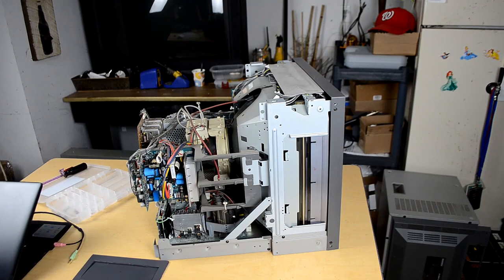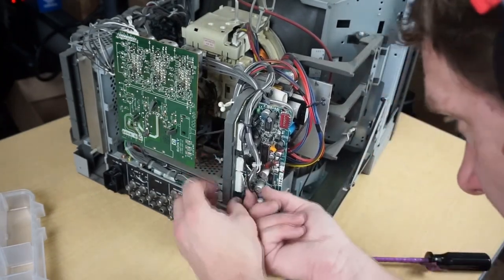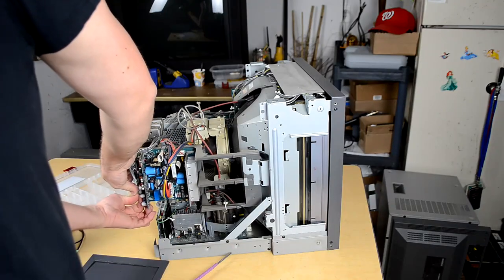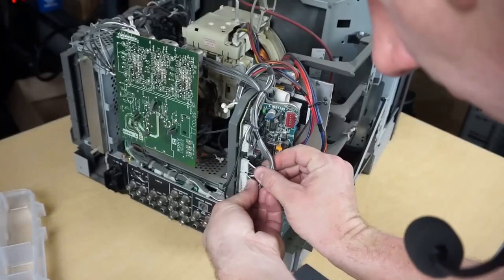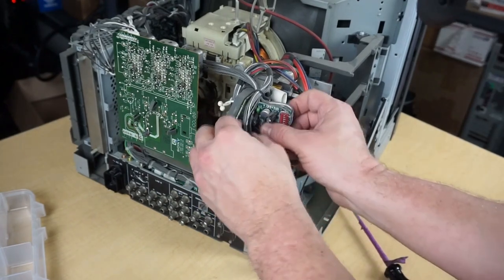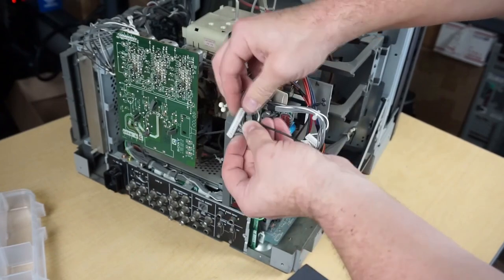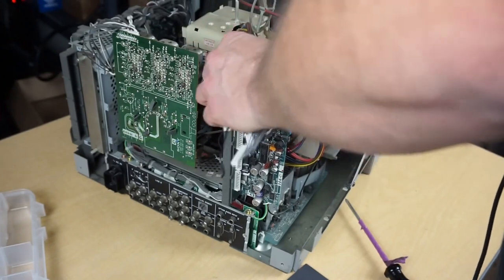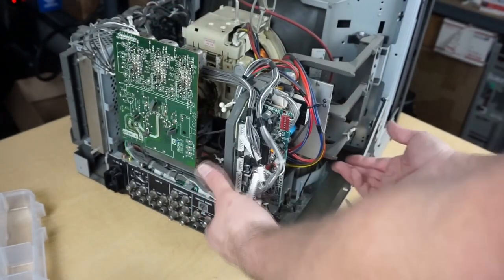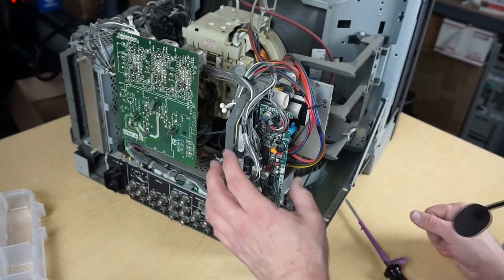The power supply is going to be in the middle of that monitor also. So there are, again, quite a few connections here. We're going to disconnect a ground connection first, if I can get in there. The good news is, on this monitor, we should be able to easily find where these connect back to. You want to be careful when doing this, though, because sometimes this plastic can be extremely brittle, and when it is, the actual brace that's moving, it'll start to crack and fall apart. And when that happens, you really have trouble trying to keep this board steady.